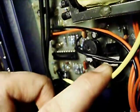Then over here is the control electronics. There's this device right here, which is a DIP-20 device. It is most likely the microcontroller, judging by the immediately adjacent crystal. It is an EM78P458AP. And over here is the 7805 voltage regulator for it. It's got this really interesting and really weird logo, which you can kind of see there. So it's some low-end generic Chinese parts fab. Really doesn't want to show up on camera. Yeah, you can see it now.